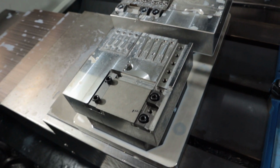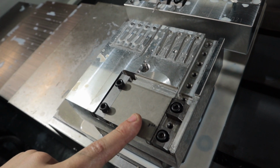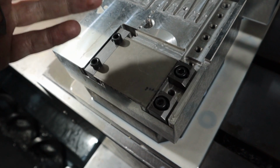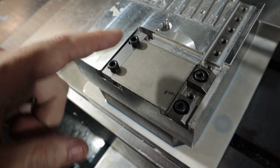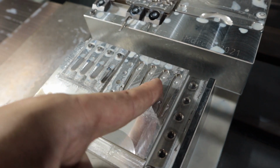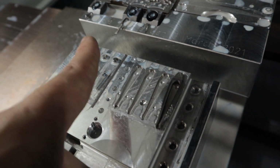Okay, so I'm sure you're curious about the fixture setup for the actual tweezers themselves. I'm using leftover stock from the knife handles. I buy them in 2" by 6" by 1/8 inch pieces of titanium, just grade 5. I'm buying them off eBay, so that's why they're such a weird size. Originally I had a backing bar here, and then I had some Talon grips here, and I was pushing the tweezers in this direction, as you can see by the profile.